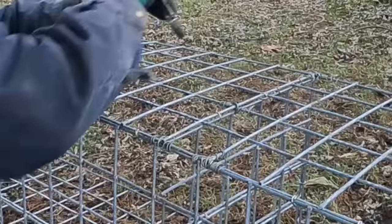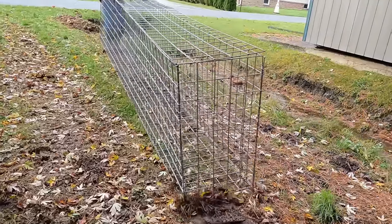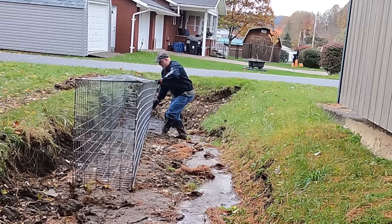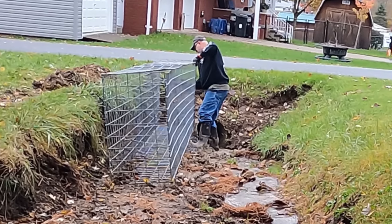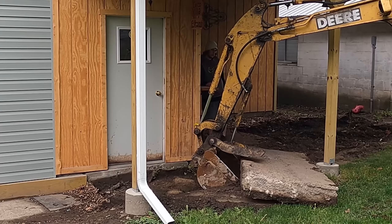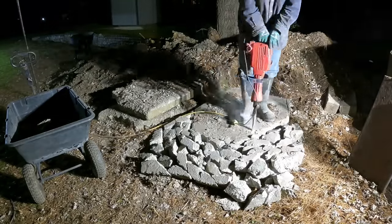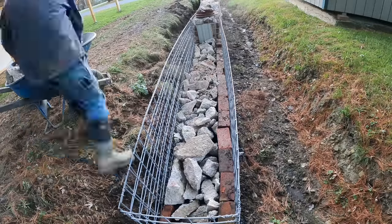Now we are going to level it in place and fill it with rubble. Make sure that you are certain the cage is where it belongs before you put a ton of stone in and then say maybe it would be better if we moved it back 3 inches. I had a huge pile of old bricks as well as old concrete slabs that I had removed for a fresh pour that I am going to be recycling to fill this wall. I used a $150 demolition hammer — I'll include the video links in the description below. The recycled concrete rubble filled this wall a lot more than expected, which is a good thing.